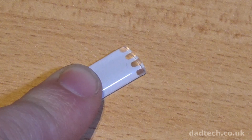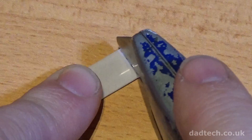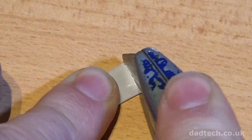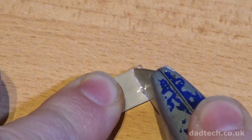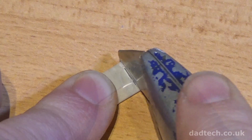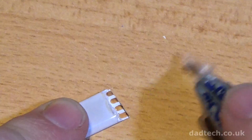The non-waterproof LED strips can be soldered to directly, but the waterproof strips have a rubber coating on them. This will need to be removed to expose the solder joints. Just cut through the rubber with a sharp knife, taking care not to cut through the strip, and scrape all of the rubber away.